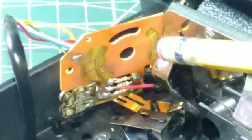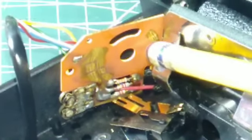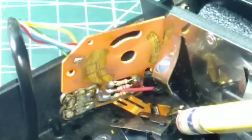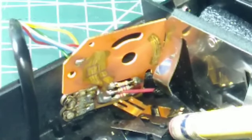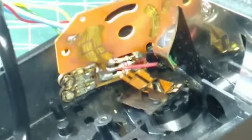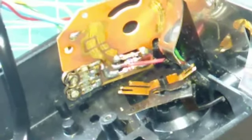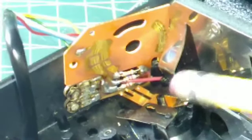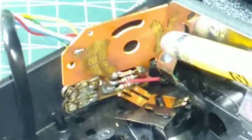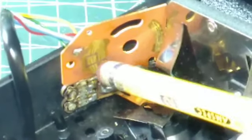So this is what we have — a classic mode switch built onto the PC board. You can see the connectors right there. What happens is: the switch on the reverse side — whichever mode you select with your finger — engages the copper plate, which has little knobs on it. Those knobs make contact with the connectors and send a signal to the brain of the unit to let it know what function you're performing.